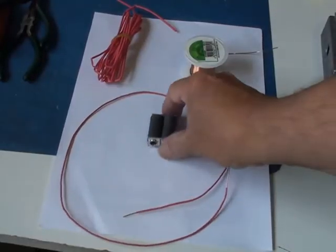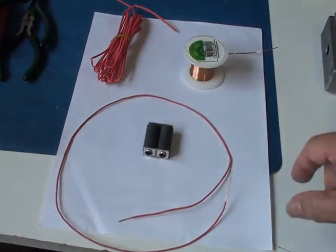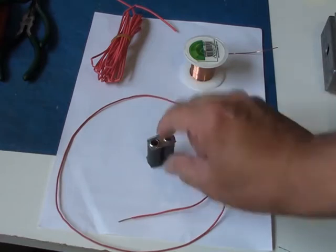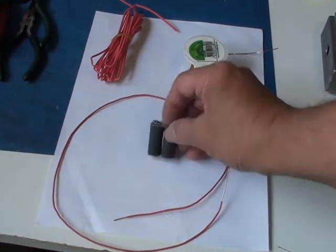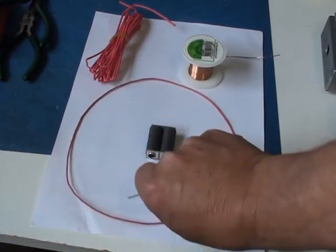Here we have a core made up of a couple of ferrite sleeves, ready to take some wire. Normally these transformers will have one turn consisting of the tubes, shorted at one end, and four — maybe three, four, or five turns of wire through the core.